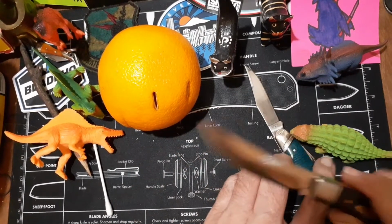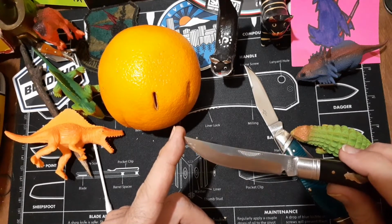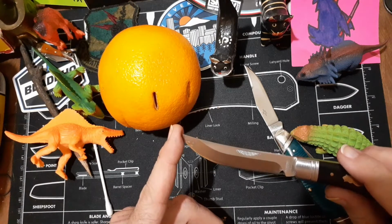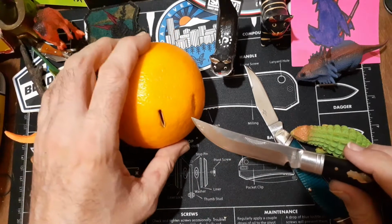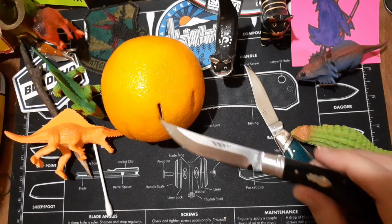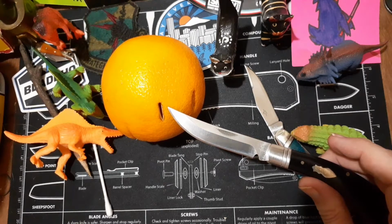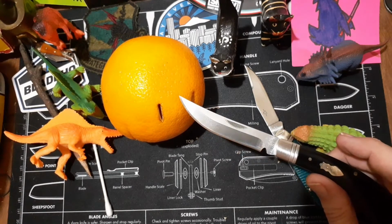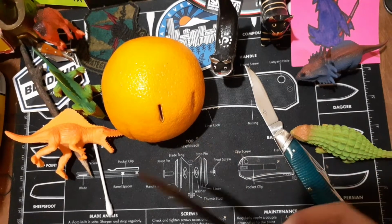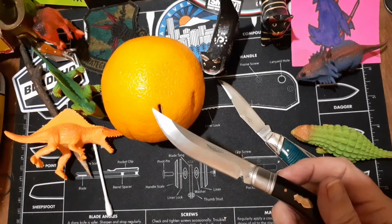Man, after putting alcohol on it to degrease it, I then set it in mustard and vinegar, and then vinegar with salt and lemon juice, and then stuck it in an orange. You can't do that with a normal carbon steel blade, man. You put a carbon steel blade in vinegar, and within 2 or 3 hours, you're going to get color change easy. I put mine in for like 3 hours just to make it dark on my Mora. So I'm not crying foul. I'm not saying this isn't T10. I'm just saying that I don't have any experience with it.